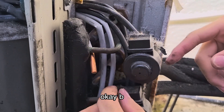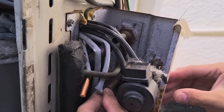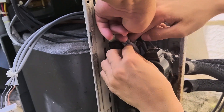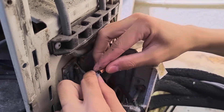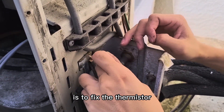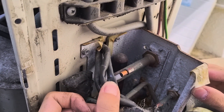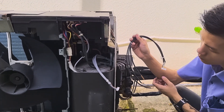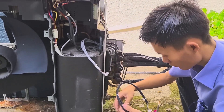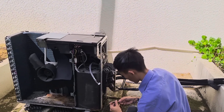Positions A and B. Unit B, unit A — this is going to open. Unit A is on top. Don't miss the pin — this is to fix the thermistor. Now we fix the liquid pipe: same length A, B, and C.